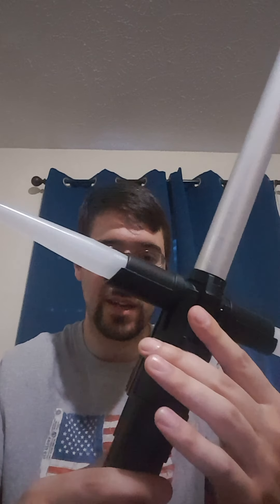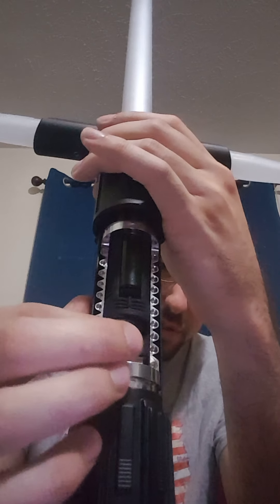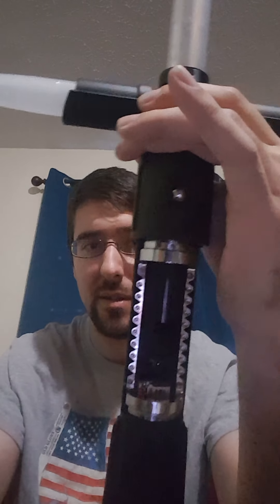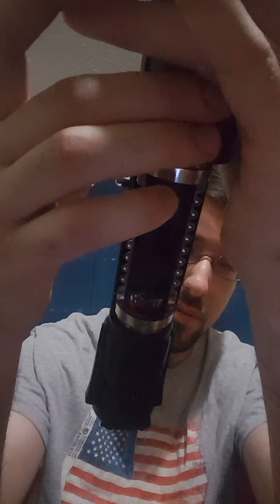There's a big craze for this — and come on, that's freaking awesome. It's running three red-red-white LEDs. It's got a Prizm 5.1 in it, a Goth Apprentice chassis. The chassis access for the kill switch and recharge port is right here; battery is right above it. It's a fixed battery chassis. You've got your kill switch, recharge port right below it, and SD card access. As I always do with Prizm and crystal focus installs, I include blinkies — little SMD LEDs — and a scrolling pattern.